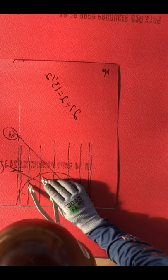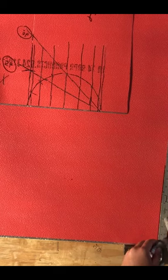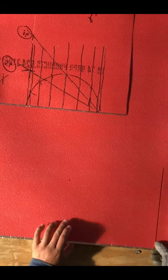Of the half circle on your right side, mark a straight line. Now we're gonna open the divider to one of the quarters we got when we divided the quadrant, and we're gonna move that — we're gonna move it about 16 times. So we mark an inch and a half to the left, then mark going left 16 times. Once you mark 16 times you'll have 17 lines, so you'll have 16 spaces. We'll go ahead and square all those marks up with a square.